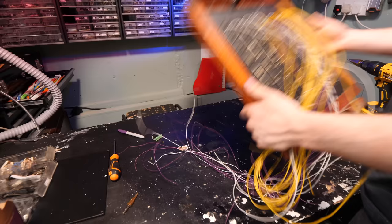So you can see I've put a diode here, here, here, and one here, here, and here. With any luck, that means if we put the settings all onto the same wire over here, it won't be crosstalking anymore. And if that works, we'll just wire the rest of the diodes in. Right, there's no crosstalk and it is working. So let's get all of the other diodes on there.